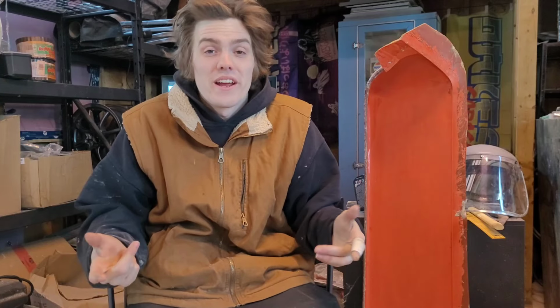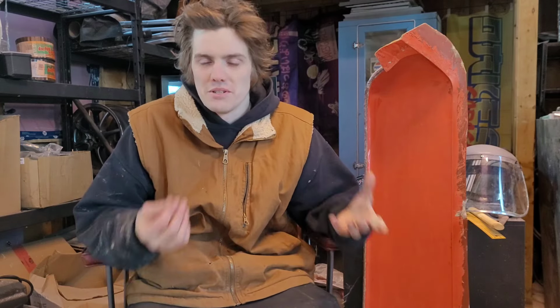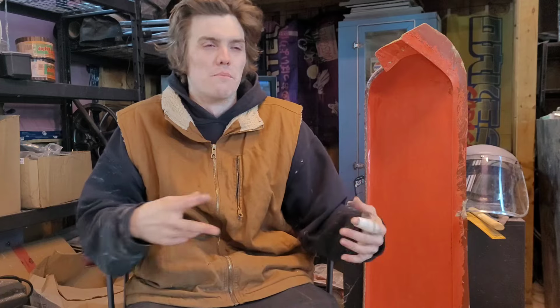Like I was saying in the video there, when I'm selling them, hopefully eventually, that's probably how it would come, just with the gel coat, and if there were any spots that had to be fixed from bubbles, hopefully not, only one on my first ones, not too bad, I think, they would be bondoed already, fully sanded and everything, just ready to go. But I wouldn't want to prime it, because everyone has their own paints that they like to use. I just feel like it might as well come in a gel coat. That's how most fiberglass comes, I'm pretty sure. Correct me if I'm wrong.